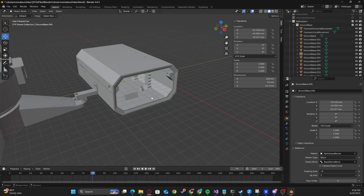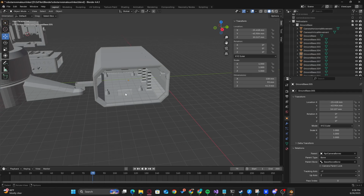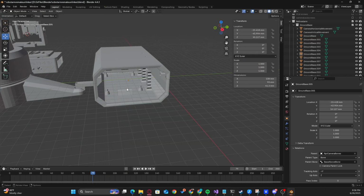Okay, so on the back, I'm going to show how the back looks. It has a place to put a little fan that's really needed, because I did have some other attachments to the RAMPS. The motor controllers on the RAMPS hat fried themselves. I'm guessing because of the heat, or I don't know if it was because of the power that I added.